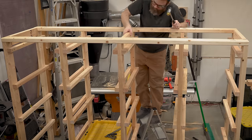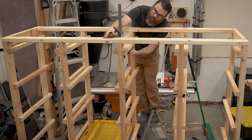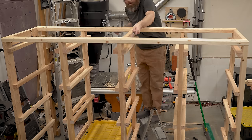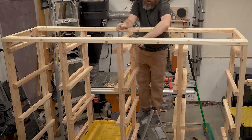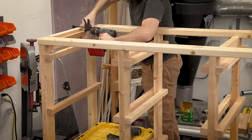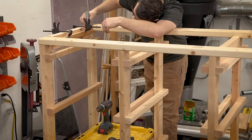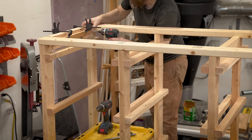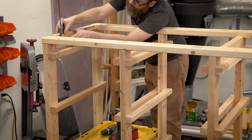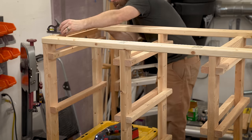For the two little shelves that are going to sit on the very top, I'm adding a center support. I'm going to use this 20-millimeter melamine from my scrap pile. I measured about 23 millimeters on my combination square and tapped in a piece to sit in the middle, so there's a little bit of a lip around the edge. Then using the pocket screws I threw that in there and moved on to the supports on the sides. I didn't plan ahead enough since a normal 2x4 would interfere with the top tote, so I'm using thin scrap pieces, marking about 23 millimeters down with the combination square, and drilling and screwing in these little rails as side supports.